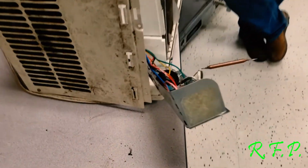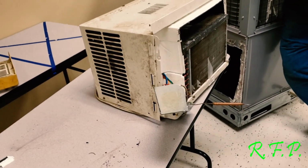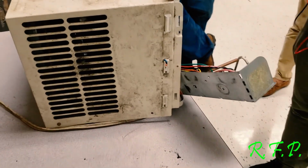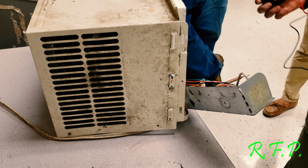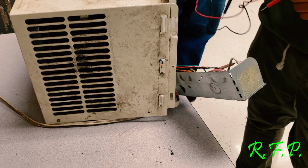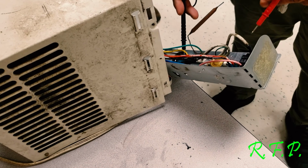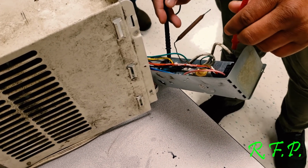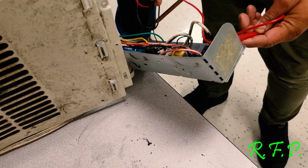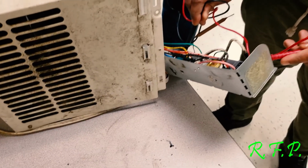Find out why it didn't run when you plugged it back in. Voltage. Gonna go to voltage. You got voltage with a squiggly line. There you go. I'll be your meter holder. It's got plastic on it. You're gonna have to get down under the edge of the plastic. 121. So you got 123 volts coming in.